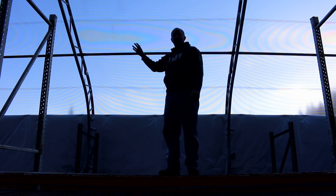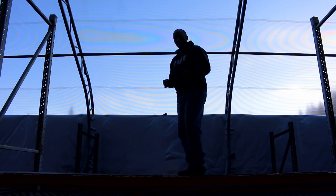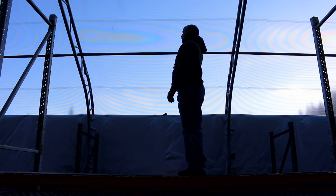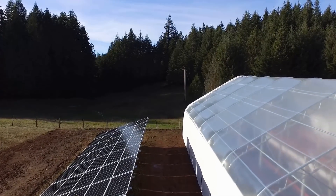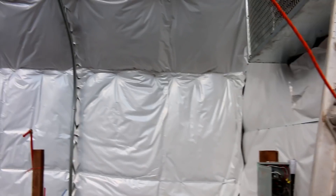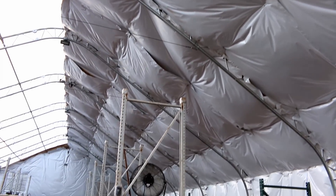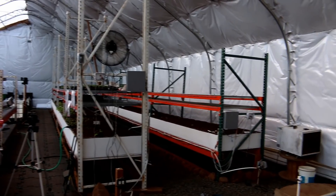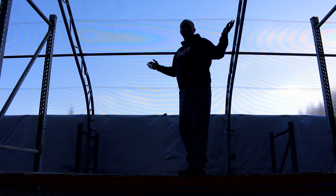We had a custom cover made for this building from the manufacturer, where we employed the principles of passive solar greenhouses. If you're unfamiliar with that, check it out on YouTube. Essentially, if you align your building east to west, your south-facing wall — in the northern latitudes — is the one that gets the most sun, so make sure it lets light through. On the north side, cover it up, because you won't get much sun there and you'd just waste heat energy. Go with a clear southern wall and an insulated northern wall and it'll cost less to heat the whole building.